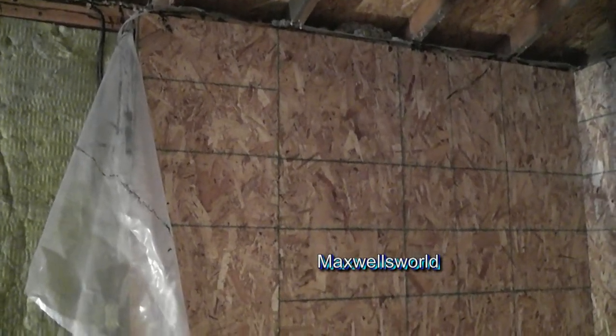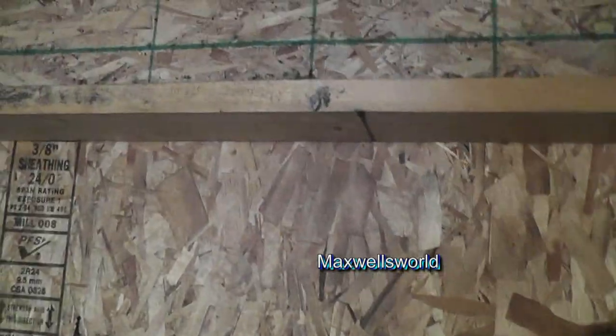Basically, as well, when I go to put it up, I'm gonna stand the OSB up a little differently too, just to get better use of the sheeting, because when I did this, I had a lot of offcuts from the shortness of the sheets, because I don't have 8-foot walls in here, right? They're only whatever they are, 7-foot walls or something. So of course, with pulling the OSB, it'll give me complete access to this window now. I can patch it, put a complete piece of vapor barrier over it, and tuck tape it, right?